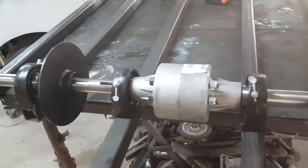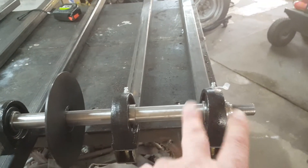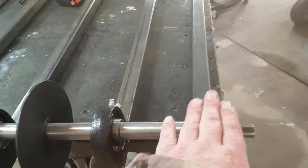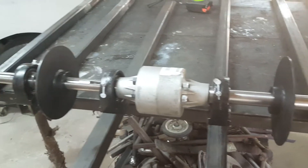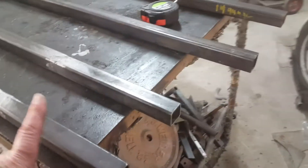You're limited by the width of the axle, which is 38 inches. Right now the frame is about 34 and a half inches wide. Once you get the track on it sits just under 36 inches. I wanted to stay under 36 inches in case I ever wanted to go through an entrance door — just a personal parameter. You could go a little narrower if you wanted, but I wouldn't go much wider anyway.